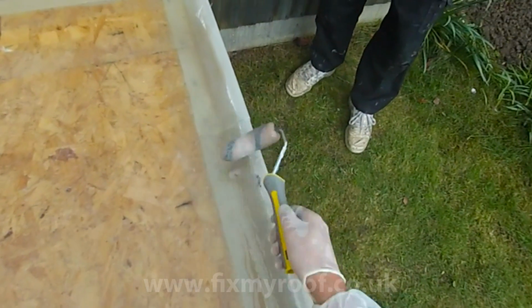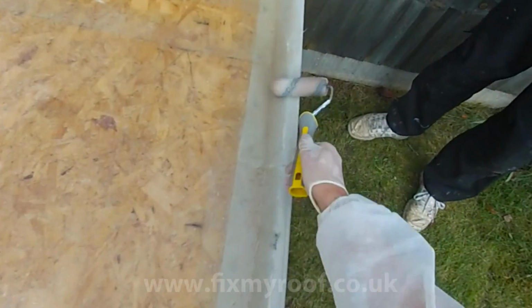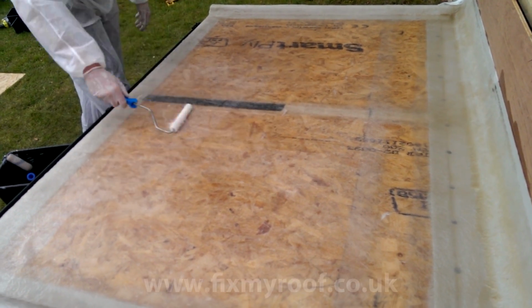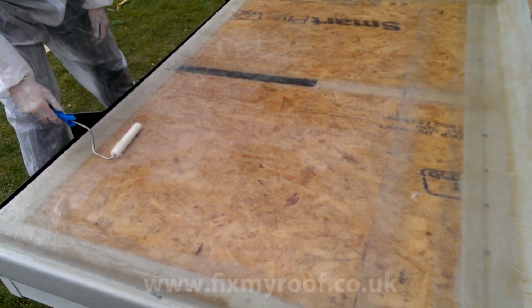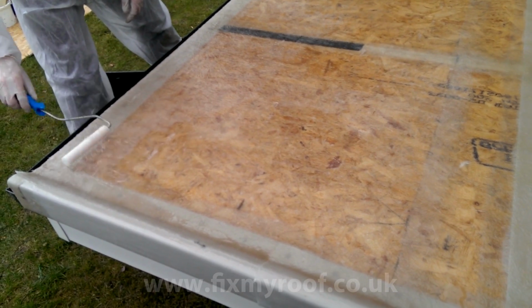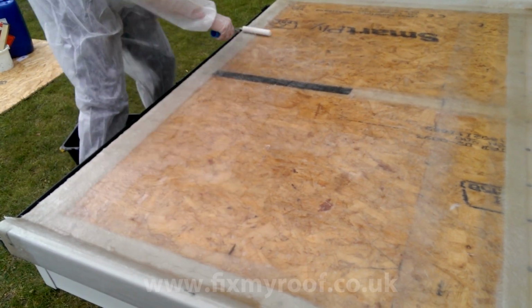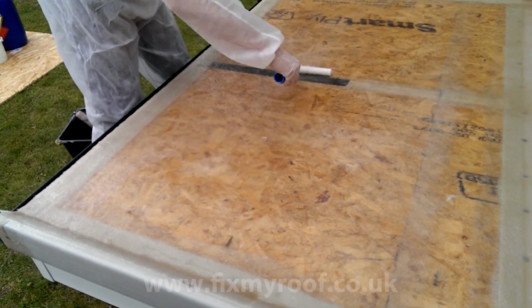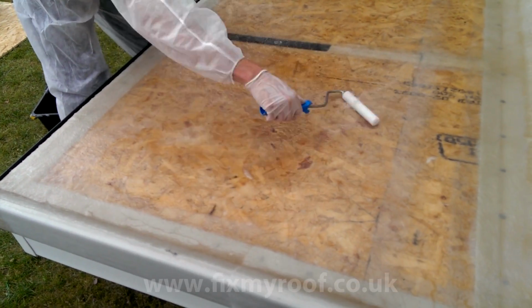Here, on the other side of the trim, I've laminated the C.S.M. up the face of the upstand. Now I'm consolidating again. 2 to 3 passes over the laminate will suffice. You can actually hear a change in the laminate as the air leaves, and when you do this you will know exactly what I mean. When it looks and sounds bubble free, it will be.